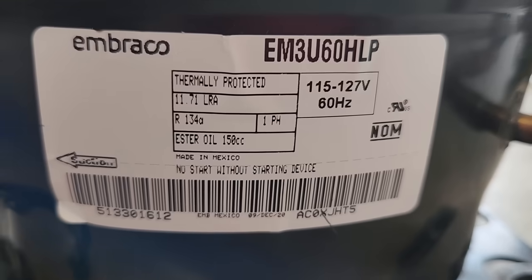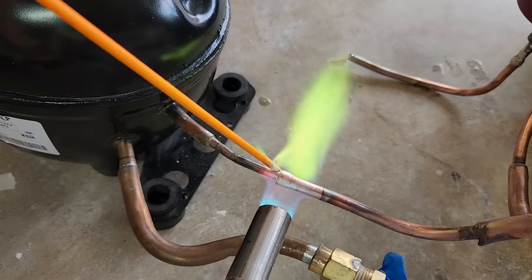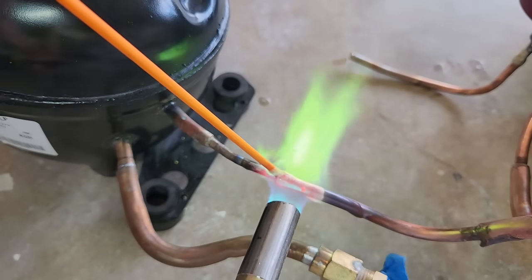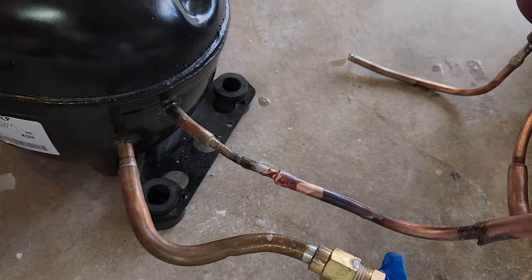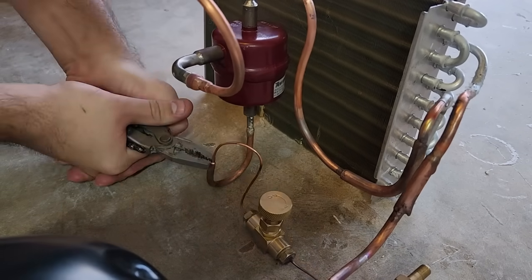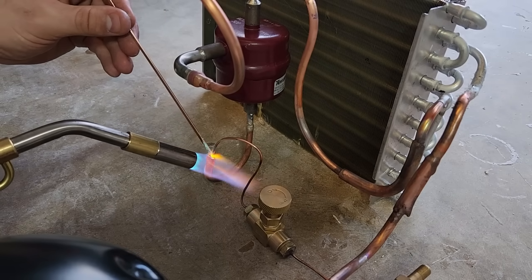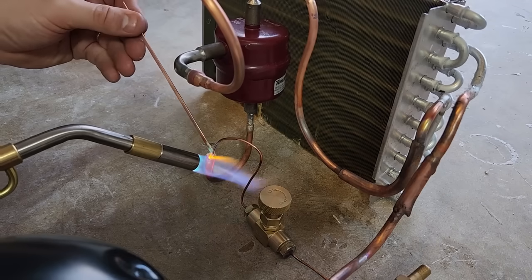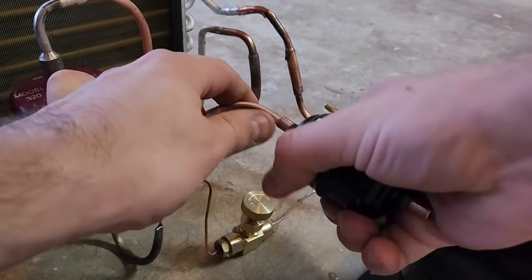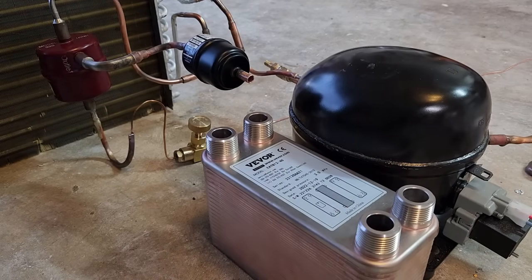In this case, it's much more important that I have a large high side pressure to ensure condensation occurs. For the second stage compressor, I used the fridge compressor that I had initially used in my vapor compression video. The outlet tube was steel, so I used the silver solder again to join it to the copper tubing from the aftercooler. For oil return, I simply connected a needle valve on a capillary tube to the oil drain line on the separator and crushed the larger tubing tight around the capillary. This would probably only have to be opened for a few seconds once per run. The crushed tubing was then sealed up with solder. Downstream of the oil separator is the filter dryer, which will then connect to the intercooler — though it turns out this setup is incorrect, which I'll get to later.